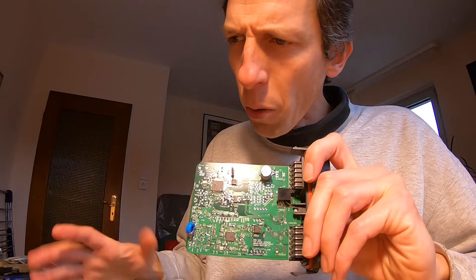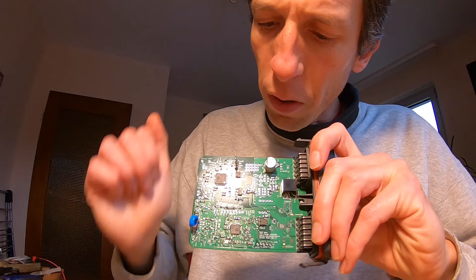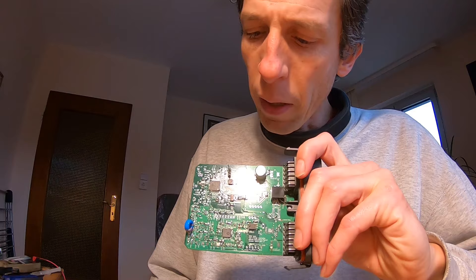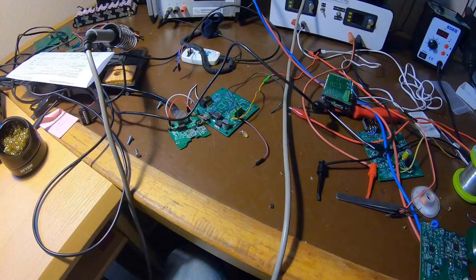This one's got 256K of flash, so it's almost the one we're using for the inverter, just a slightly larger variant. It's got more RAM and more flash because CCS is so convoluted. It talks to the QCA chip via SPI, and the QCA chip talks to the powerline modem inside the EVSE. The CAN chip talks to the car — to the BMS or VCU — which tells it which voltage and current we want to charge at, and what the state of charge is. So it's essentially an adapter, a bridge from CAN to powerline.